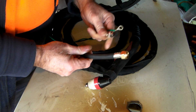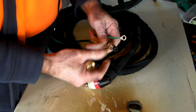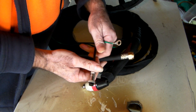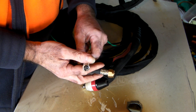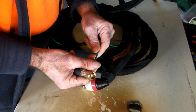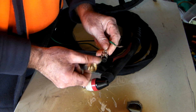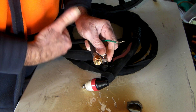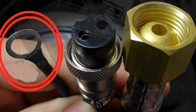So anyway guys, this is a non-touch plasma torch and on this the connections are as follows. We've got our little 16mm here - that is for our airline that plugs into the machine. We've got our little one here for the switch, that's your on/off switch on the torch. And then we've got this one here which is your non-touch lead or your pilot arc lead that goes onto your machine. Where people get confused is some of them try and run this sort of torch on a non-pilot arc machine. You have to have the three connectors - one, two, three - to run the true pilot arc system or the true non-touch system on your plasma torch.